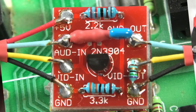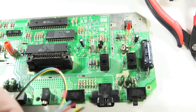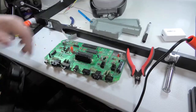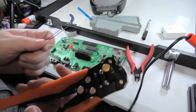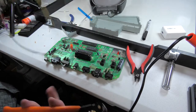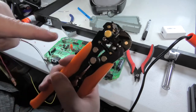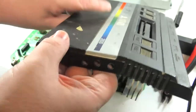We have to be careful with where we put these wires, and the ends weren't even pre-stripped. I've got to go get my wire strippers. The wire stripping tool — put it to a really light setting because this wire is really thin, it could break. Put the wire in, squeeze it, and it strips.